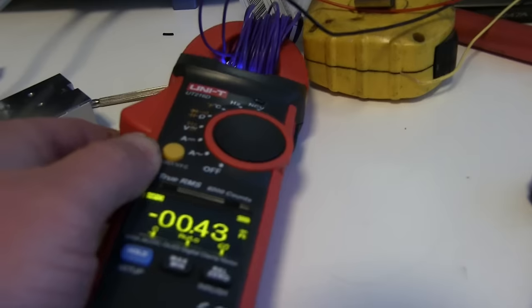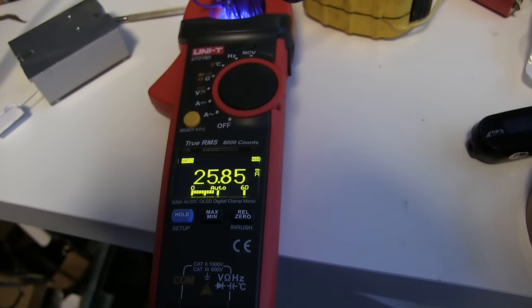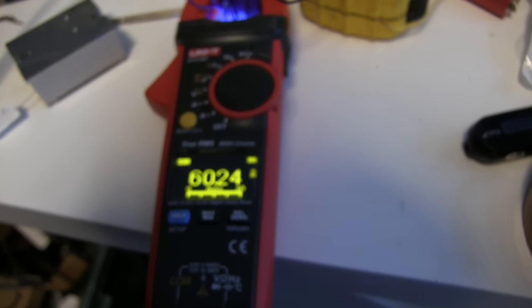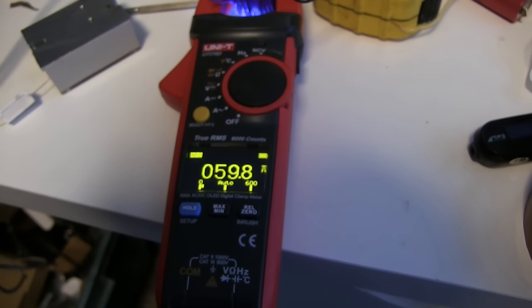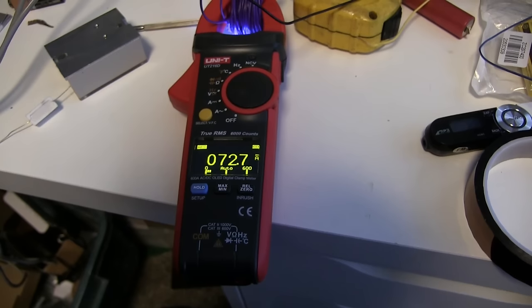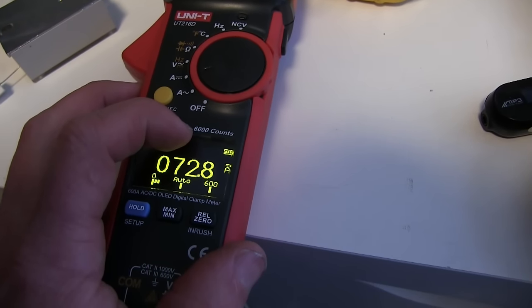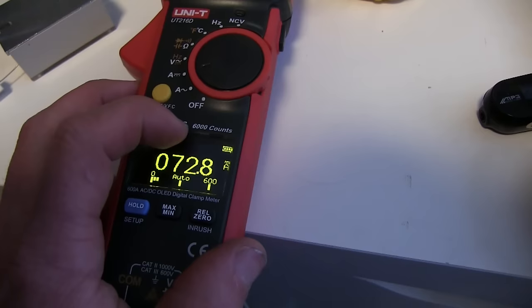Watch what happens when we hit 60 — it has to change scale, as you can clearly see. That is what the count means — it can count to 6,000 and then changes scale. So we'll go 5999 — goes up to 599, goes overload, and then pops over. Cha-da! Now, some might treat this as pedantic. However, the count has nothing to do with accuracy or precision — and accuracy and precision are two entirely different things, as is count. It's essentially just how many digits it displays.